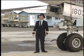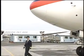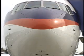At the nose of the airplane, confirm that the forward equipment center access door is closed and look for visible damage on the skin, radome, and the lightning conductor strips.